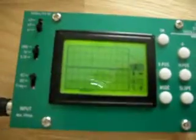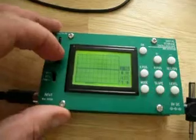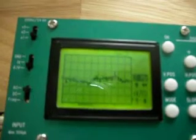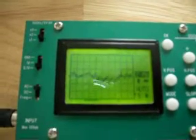What I'm going to do is show you what happens when you insulate yourself from the tiled floor. So I'm going to step on top of my shoes. I'm now insulated. And the only thing that's changed is I insulated myself, so that voltage went down to almost nothing. I'm going to switch the display down to the lowest setting, so we're on 0.1 volt per division. And we can see that we've just got general electrical noise flowing through, and it's in the range of about 0.2 volts peak-to-peak, which most people consider normal.